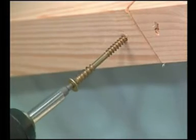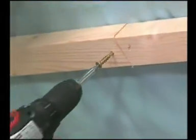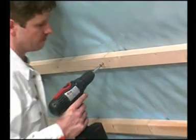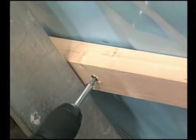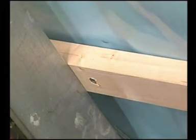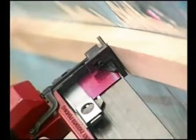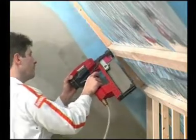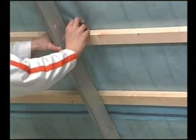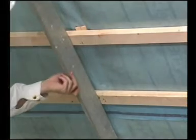The battens are typically fixed to rafters and joists with screws. Where rafters are uneven, this may be corrected using special screws. Alternatively, pneumatically applied nails or staples may be used to affix the studwork. Here a timber wedge is used to ensure the battens are level.